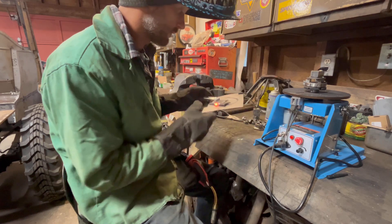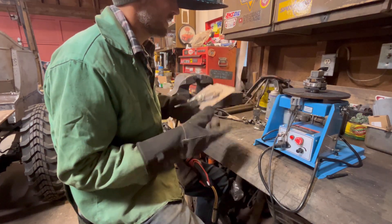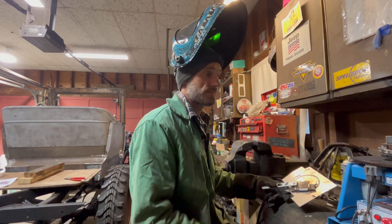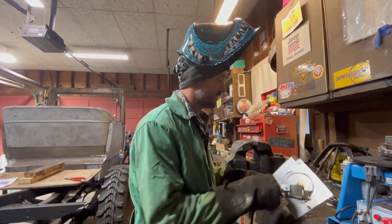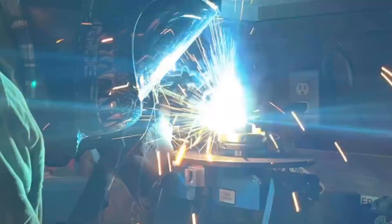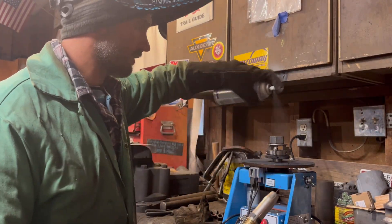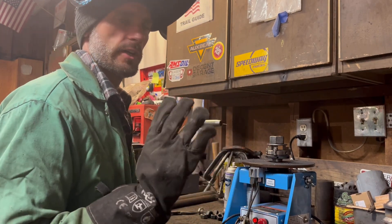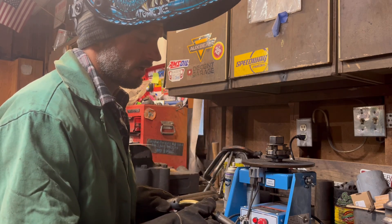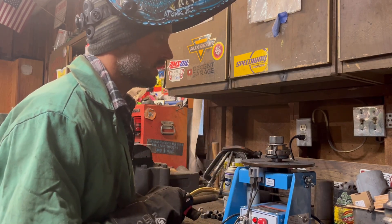Definitely throwing plenty of heat — I think I'd turn it down even more for that. I think it's pretty good. I'm using the rotary table for this job — I'm not just mocking up a fake piece of metal to show you this welder quick, I'm going to dive right in and hope I don't ruin any parts. Just getting used to the machine. So far I'd say I'm digging it, keeping everything coated with some anti-splatter. It has a little bit of a jumpy start from when the wire comes out to when the voltage kicks in, and it may move your part a little bit. Keeping your wire short is going to help with that. But once I get rolling, it's laying down some nice welds.